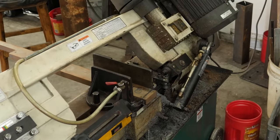I finished cutting the grooves on this side of the handle. The next thing is to dovetail the bottom of the groove — right now the groove is rounded at the bottom and I want to open up the bottom so that when I smash the gold in it locks it in place. I've got a small carbide burr that I've custom-ground with four sides that do the cutting, and I'm going to go in at the bottom of the groove and cut a little bit of a dovetail on both sides all the way down. I've got all my grooves cut in and dovetailed so the gold will fill out the dovetails when I smash it in and be mechanically locked into place.